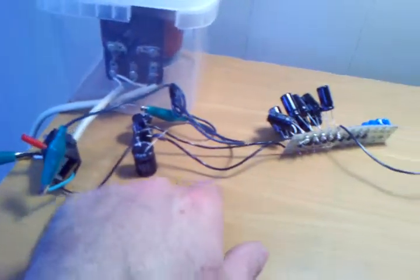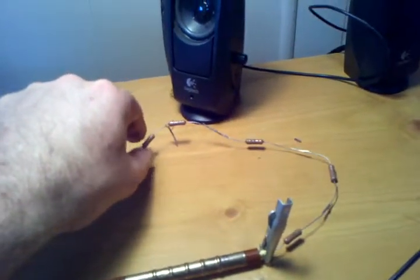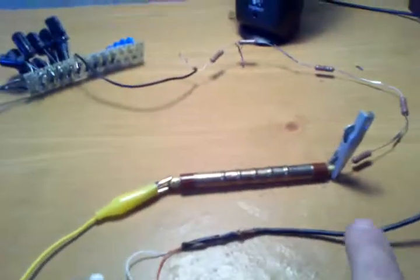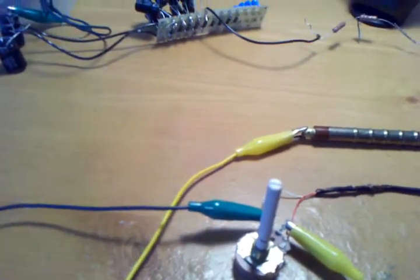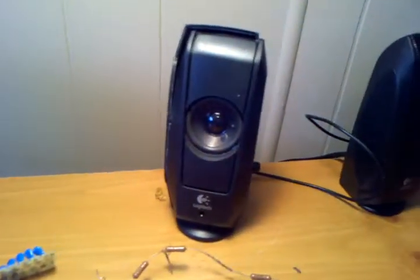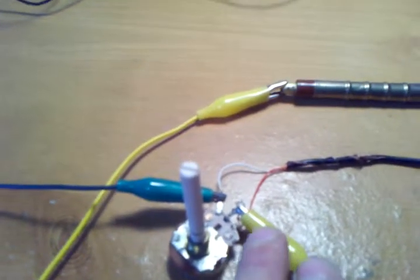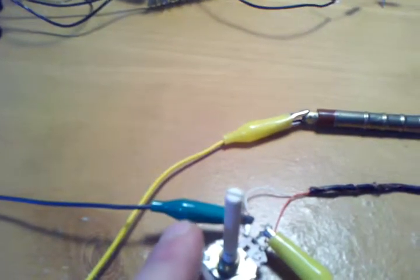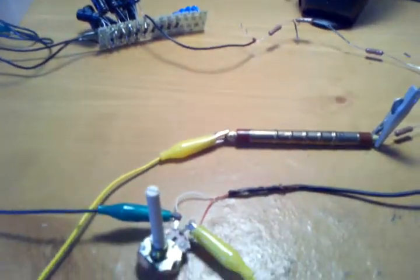So I've got the voltage multiplier and it goes to five one-meg resistors, then to about 150 ohms, and then back to the negative. And then I've got a set of old junk computer speakers with the input line — one wire before the resistor and one wire after the resistor on the negative side of the Geiger tube.